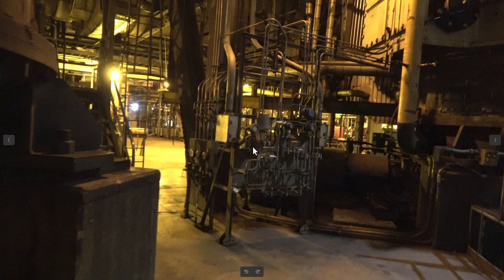There's another picture of the instrument control rack. All these little air tubes are measuring DPs across the pulverizer — air pressures. DPs are really critical on these if you have something plugging up. Once a week you have to use the instrument air and blow these lines out just to make sure they don't fill up with dust. There are also magnehelic gauges so you can see what the pressures are. All of this shows on the control room on the pulverizer page — it's kind of nice seeing it in real life so you know what you're really working with.